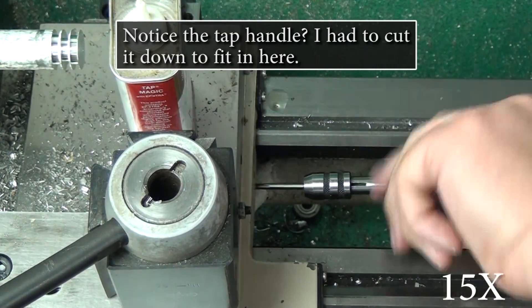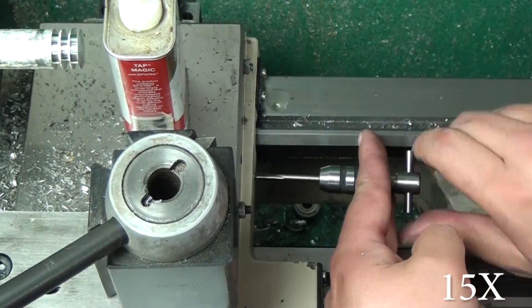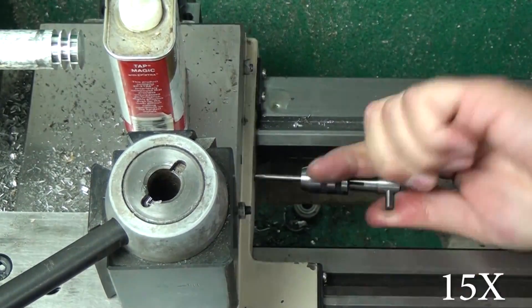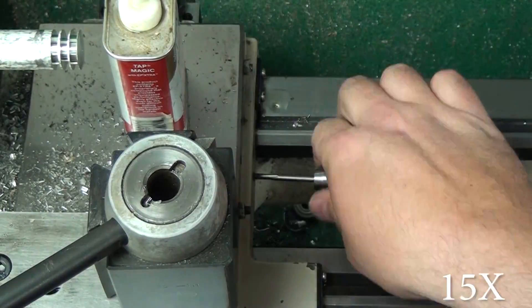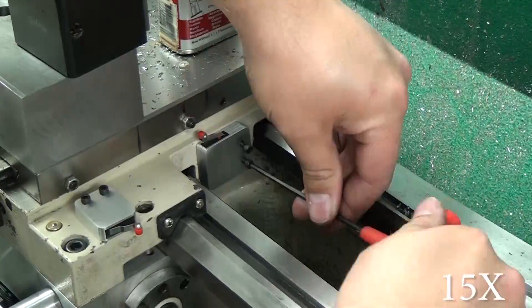Because they share one input, you can't home the X and Z axes at the same time — they need to be homed one at a time, so I always do X first and then Z. That's really all there is to it. Go check out my GrabCAD if you want to download these files and use them however you like, and I'll see you in the next video.